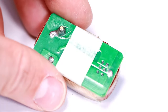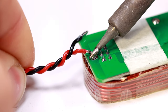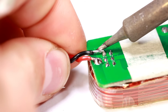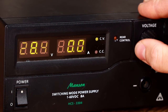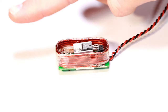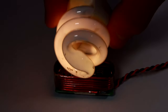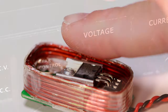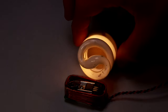Back to our module. It's not immediately clear where the power supply connects, but there's a hint on the website. I now solder one cable for plus and one for minus to the PCB. We will start powering it with 12 volts and then go up until the transistor dies. You should definitely not touch the device during operation because you can get a high-frequency burn. With an input voltage of 15 volts we can excite a fluorescent lamp to light up — very cool! The transistor stays cold.